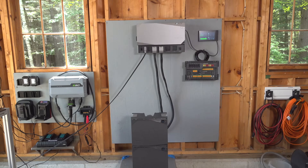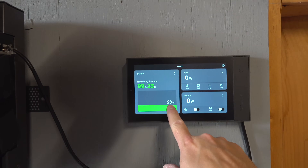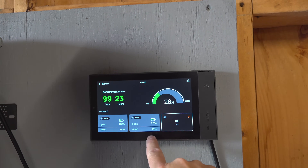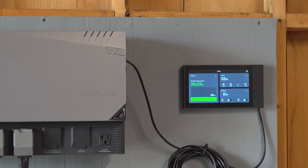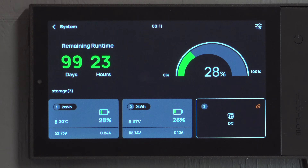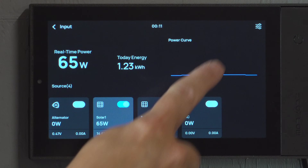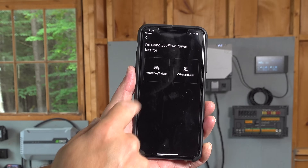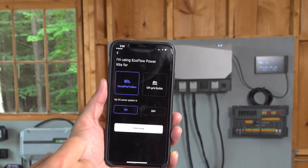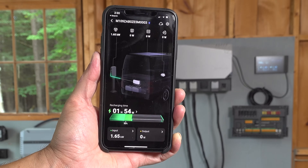As soon as I plugged in the solar panel, the system immediately powered up because it could sense the voltage. Now if you're using this in an RV, it's advisable to install a solar disconnect switch in case you need to work on the system. Keep in mind, everything in the system is already working — I have not logged into the app or programmed anything. The display is already on and reading the input power. You can also control the system using the included app, and you can do things like renaming individual circuits to completely customize the system.